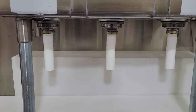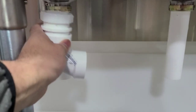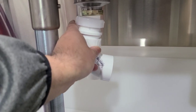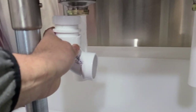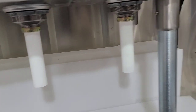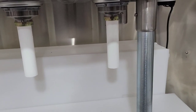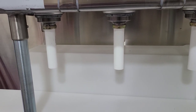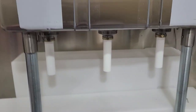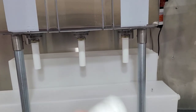There are the three pieces we're going to end up cutting. We're going to use a one-and-a-half-inch elbow with the trap adapter and get almost a downhill action so water just flows downhill and out. I saw this setup at Domino's Pizza — I do a lot of work for them — and figured if they can pass inspections, it's good enough for me.